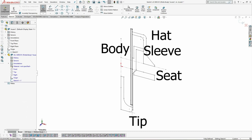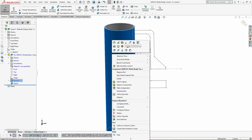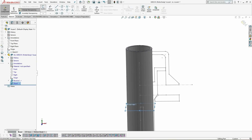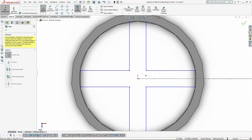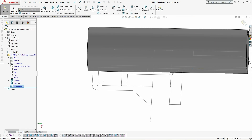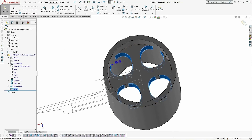Now that I've completed the sketch, I'm going to create a new part and reference the sketch at the assembly level. This way, if I make changes at the assembly level, they'll all propagate to the individual pieces of the engine. After I copy in the sketch, I revolve the sketch around the central axes of the part. For some parts, like the pintle body, I need to add other features at the part level. For example, here I'm adding the cruciform support structure.